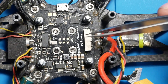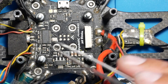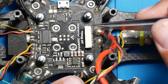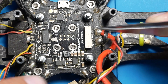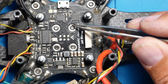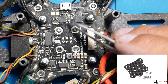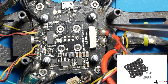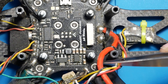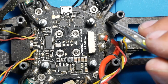So this is a change - on the Steel PDB as you'll see in most videos, the LiPo lead was coming out the front. Now the LiPo is coming out the back. It no longer attaches by grabbing the PDB with lock nuts and putting all that stress and pressure on there. There is a little blank plate you get, and that plate holds the frame together. You get a very thin set of double-sided sticky tape to hold your PDB to that brace, and there's a spot on the brace for a zip tie. By doing that, if your battery were to eject, the brace catches the impact rather than it going directly onto your PDB.